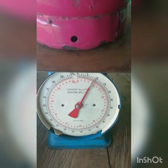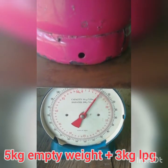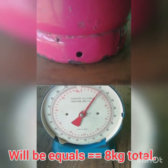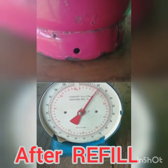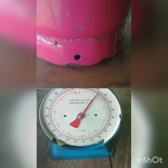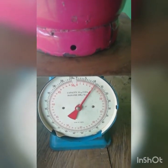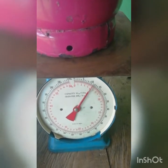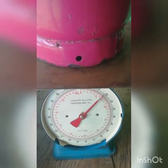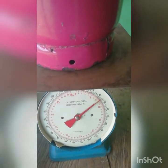Assuming the empty weight was 5kg and you want to achieve 3kg, all you need to do is place the cylinder down, fix your fitting, and refill until it reaches the target. Just use your phone or calculator: 5 plus 3 gives you 8. So 1kg stops here, 2kg here, and 3kg here — once it gets there, you know your gas is accurately refilled.